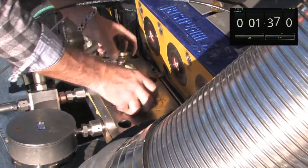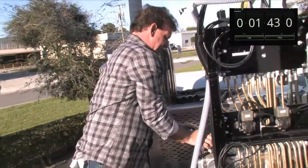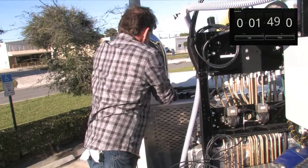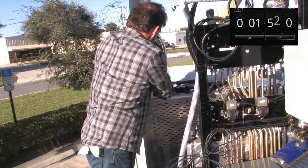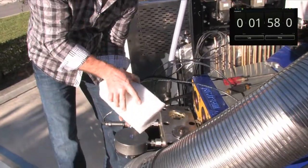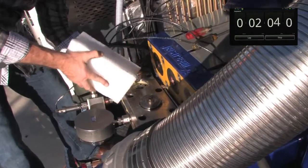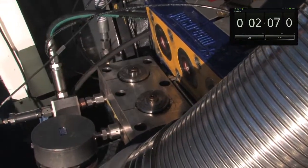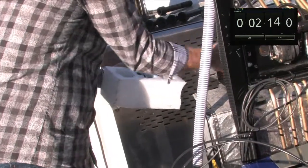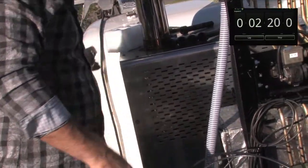Here at WTI, we recommend carrying three fully lapped valves ready to go. In the event that there's any issue, simply place your lap valves into the chambers, and place your used valves into a carton to go back to the shop and be serviced in the shop environment.